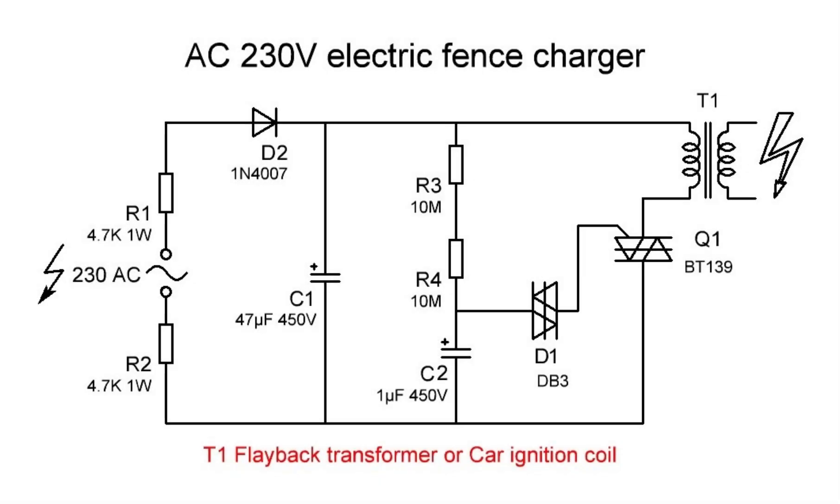In this video I'm going to show how to make a direct AC 230 volt electric fence charger circuit. This circuit works directly on 220 or 230 volt AC and can be adjusted to work on 110 or 120 volt AC. This simple DIAC-controlled circuit is well known and finds various industrial applications — it flashes once every second to give a high voltage on a flyback car ignition coil and is simple to design.